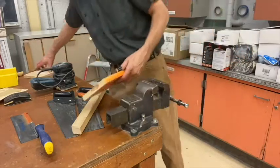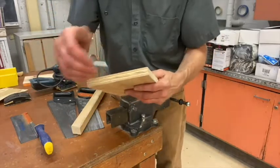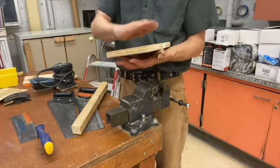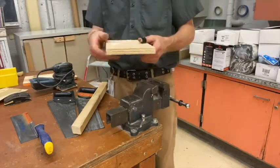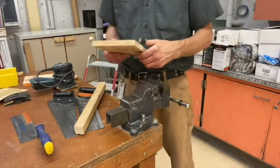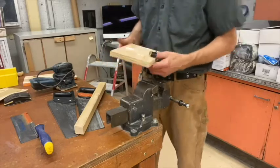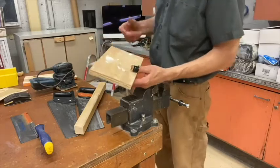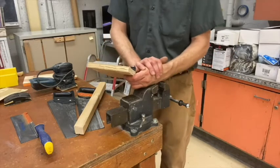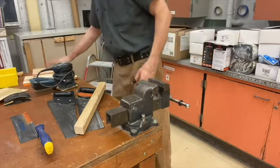Another type of wood you may have come across is plywood, with layers that have been glued together. And the grains are going different ways then. So that makes it stronger, like for big panels. But with the glue in it, with the way we were using it, there's a lot of wear and tear, because the glue is more aggressive on sanding. It wears out and clogs up abrasive papers and abrasive belts, as well as dulls blades quicker.